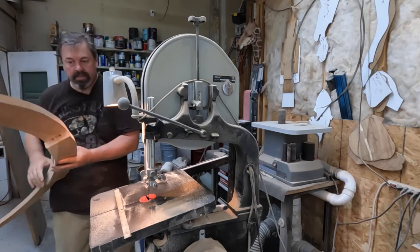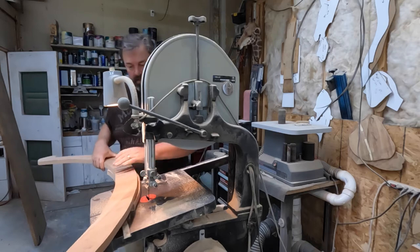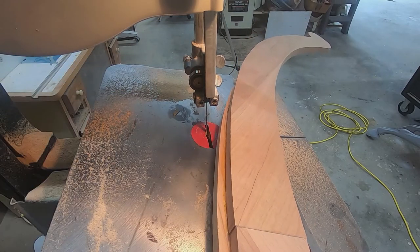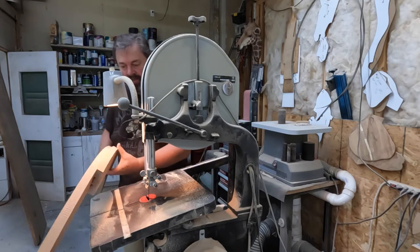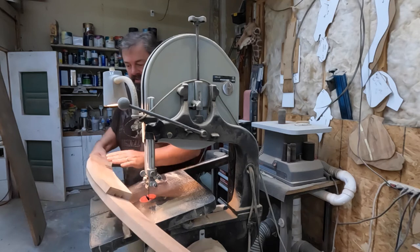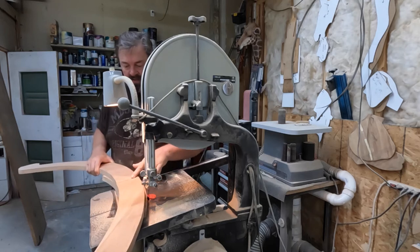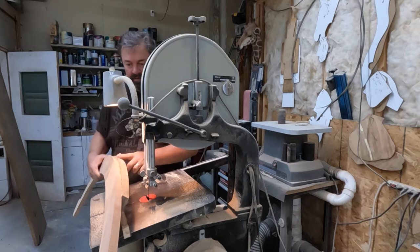Here's my second bow rocker, and I wanted to bring you in. I set the other camera up on top of my bandsaw here so that you can see. Again, when I talk about the box, I'm talking about this piece here. I call this like a stretcher, is what I'm calling this. And again, I clamp and glue this on, and once that's all dry, then that secures this seam right here, and that will never come apart as long as we have a good glue joint.